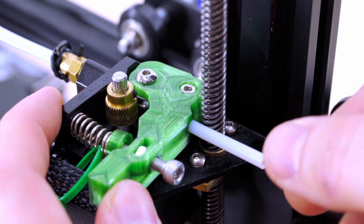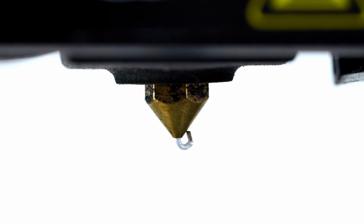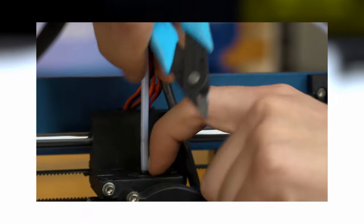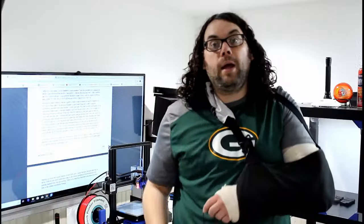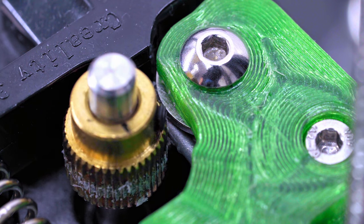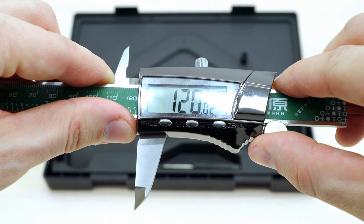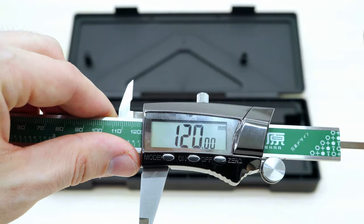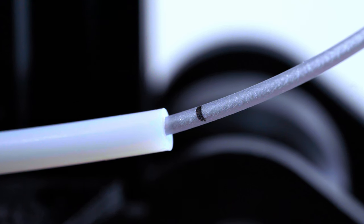After heating the nozzle, insert the filament up to the nozzle — do this in both cases, whether you have a Bowden extruder or a direct extruder. Manually push some filament so the nozzle will not be thirsty anymore. In many videos, the Bowden version is calibrated with the PTFE tube disconnected, but this is not correct for a 3D printer — because of nozzle pressure or weak pressure on the filament, the printer can start losing steps or the filament can slip. Therefore, calibration should be performed under the same conditions as during printing. We take a precision ruler and find 120mm on it. 100mm is the length of filament we will push through the nozzle; the remaining 20mm is a backup in case your printer pushes more than expected.